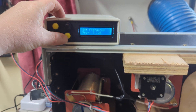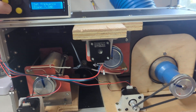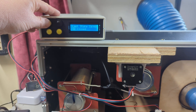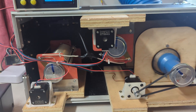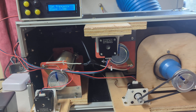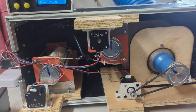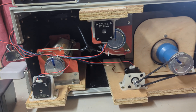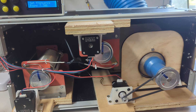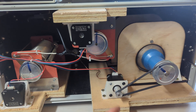Going a bit higher — the inductors will move as well. No, it's all capacitance on this band. I can get a pretty good match up to about 20 meters, but I think I'm going to need to put a heavy-duty relay in here to switch some capacitance on the transceiver side for the higher bands.